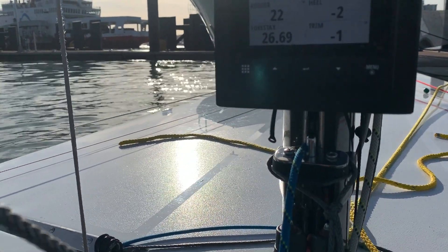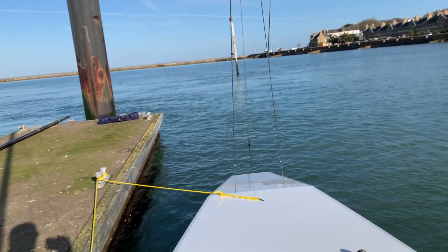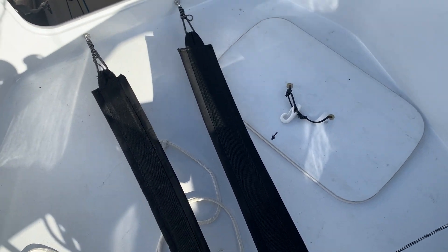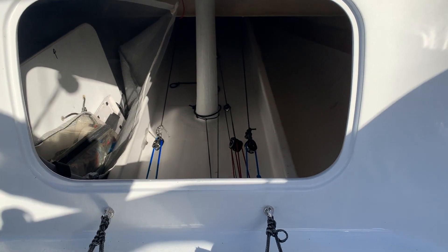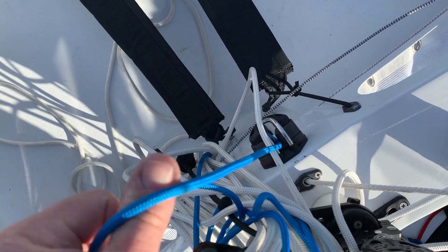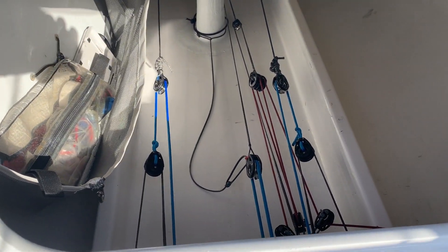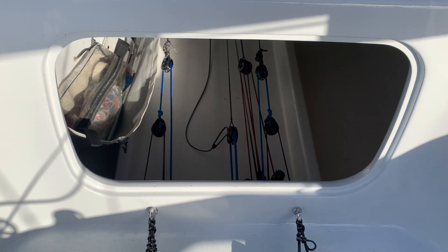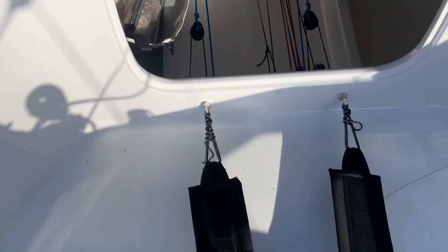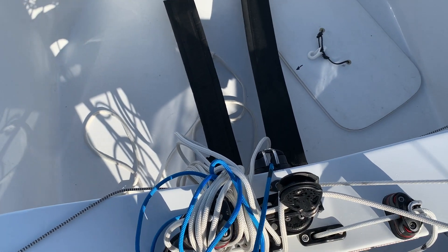No nonsense — you just can't get that wrong in the heat of battle. Another thing is the backstay: the rig goes a long way forward on these boats, similar to a Star boat or even an Etchells. So backstay coarse tune as we come into the bottom mark — you can see the systems back here together with the runners. We have a mark, but we also have a stopper: a loose strop attached to the rudder stock, so when I pull this on it won't come any further. When we come into the bottom mark we just pull as hard as we can and it goes to the same point as the last windward mark.